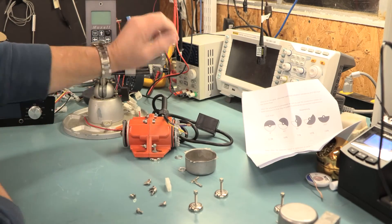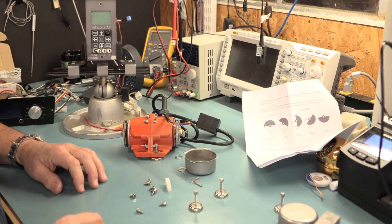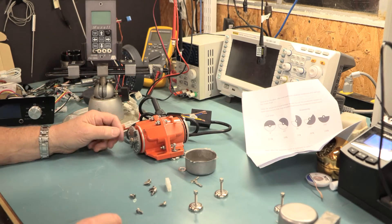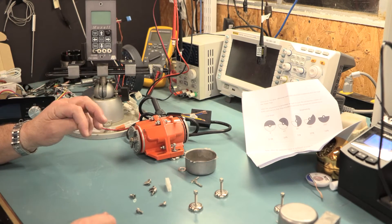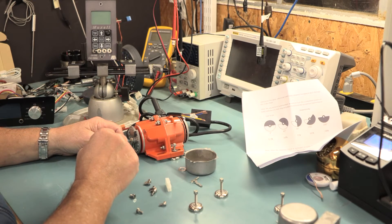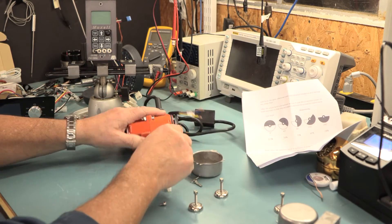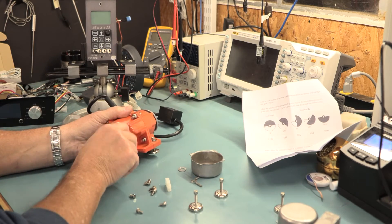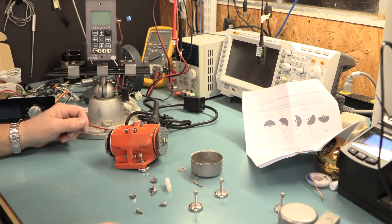I've done a video on making Molex connectors. For testing, the best way is to connect it to your grill — make sure to unplug it first, then connect it. The Muxol Pro has a manual override, similar to the auger and fan, so you can turn it on and off and tinker with it. When I was testing it I left the caps off so I could take the motor off and adjust the weights to where I liked them.